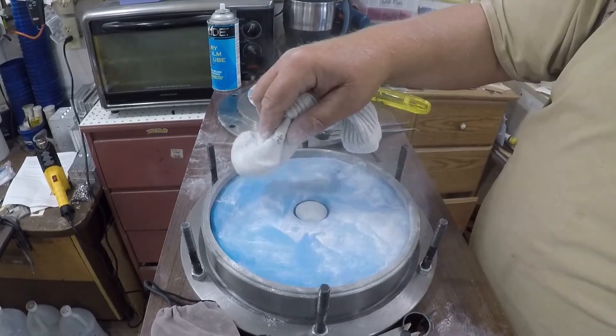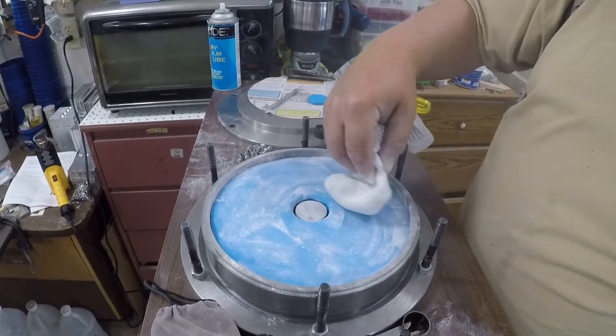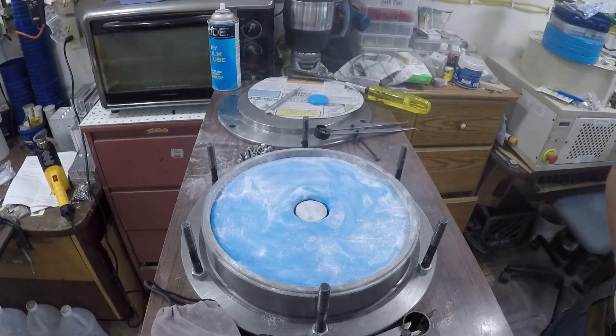I lay this in there and I come in with it, just like that, and I work that around. You'll find where the locators are and you don't want to have air pockets in there. The halves are together - they're quarter inch thick. You can get another mold plate that's thicker than this and do thicker jigs. Now comes the next step - spray silicone on there, then comes the talc.